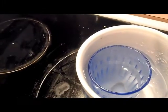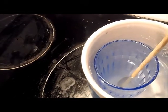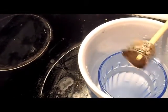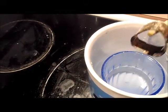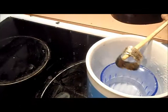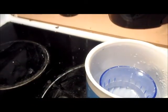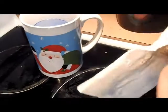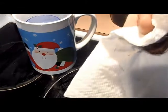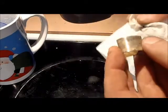It's been probably about 15 minutes, almost 20. We're going to pull this out — you can see it is definitely more silver. Still got some black scale on there, but just let me mix this around and clean this off. I'm just wiping this with a piece of paper towel and you see that scale, all that black stuff, just wipes straight away.